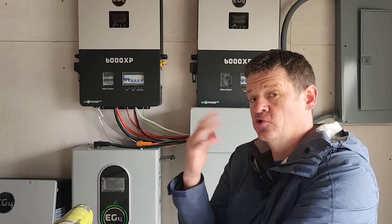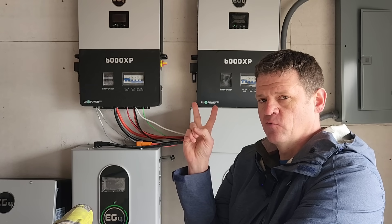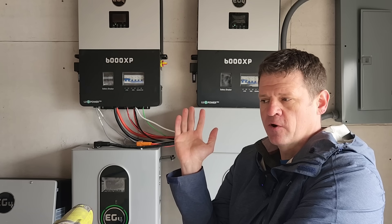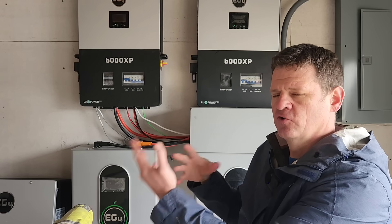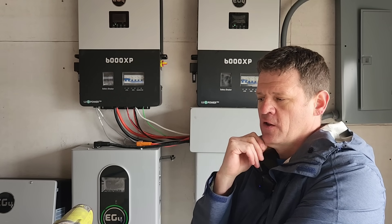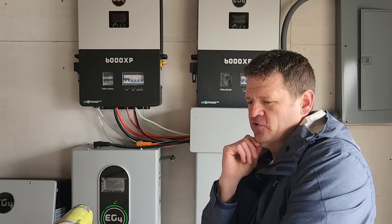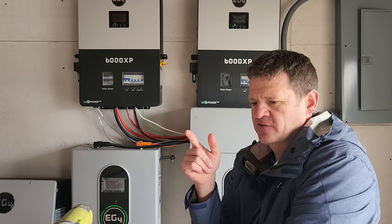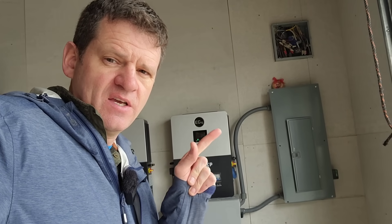In the future I'm going to recommend getting a larger single inverter instead of multiple smaller ones. With multiple smaller inverters you have redundancy if one goes bad, but it doubles your chances of something going wrong and doubles the work. I'd rather have one better inverter with a longer warranty — like a 10-year warranty — with higher output. Having only one inverter also greatly reduces the number of wire connections, reducing the chance to screw something up. Let me know in the comments what you prefer. The system is back up and running perfectly. If you want to see the home electrical analysis I did and the things I fixed, check out that video — catch you on the next one!